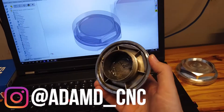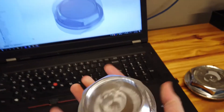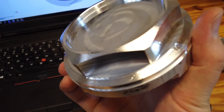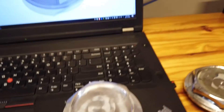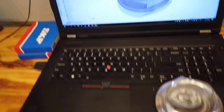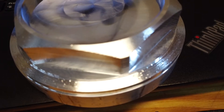In this video I'm going to talk about the making of these center caps. These are out of plastic and I'm trying to copy them out of aluminum. This is sort of the first crack - op 1. The 3D surfaces here didn't come out the greatest, so I got a new finishing end mill. It's a 4-flute coated end mill, not exactly ideal for aluminum and it was a little worn out, so I think that's why I'm seeing this.